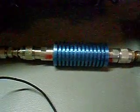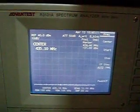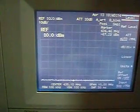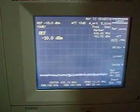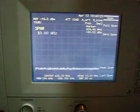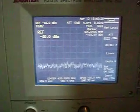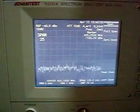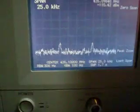I have an extra 20 dB attenuator which I put into my spectrum analyzer. Now I go to 435.1 MHz and go down in level. Going to 100 KHz bandwidth, then even lower to 25 KHz bandwidth. And there we see two tones — very tiny.